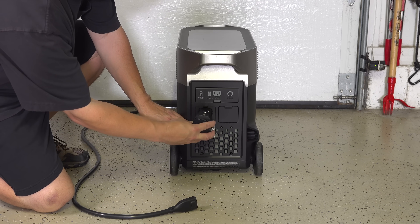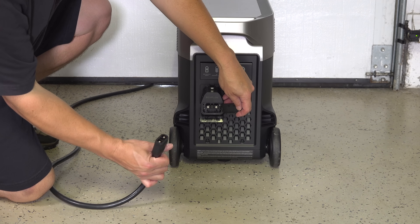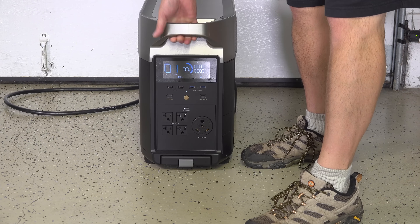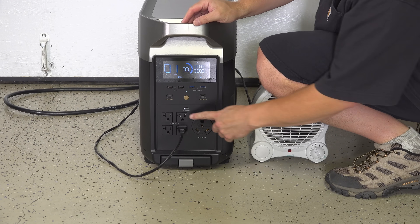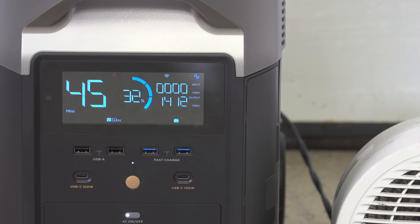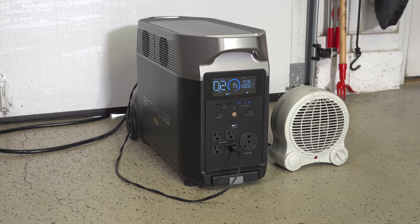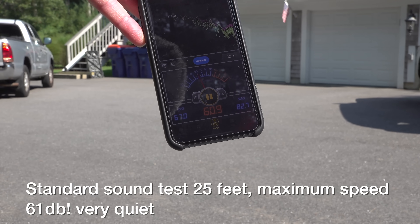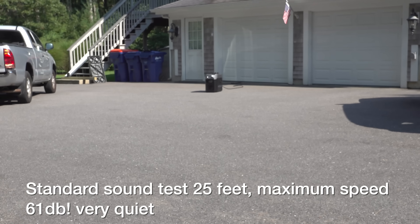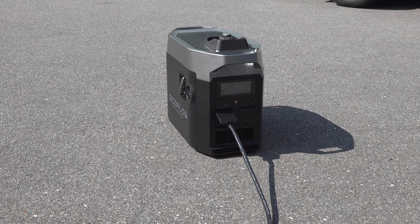Here's how it works: you plug one end of the cable into the back of your Delta Max or Pro, and the other end goes into the smart generator. You could have it connected directly into your house or connected to solar panels and an AC charging line. When you run out of power, that's when the smart generator will kick in. They pre-program it so that when the battery gets to 20%, it'll automatically tell the smart generator to start up and charge the Delta Pro's batteries. The smart generator will automatically run until the battery on the Delta is fully charged, or you can pick a setting — you can control exactly when the smart generator starts and when it stops.